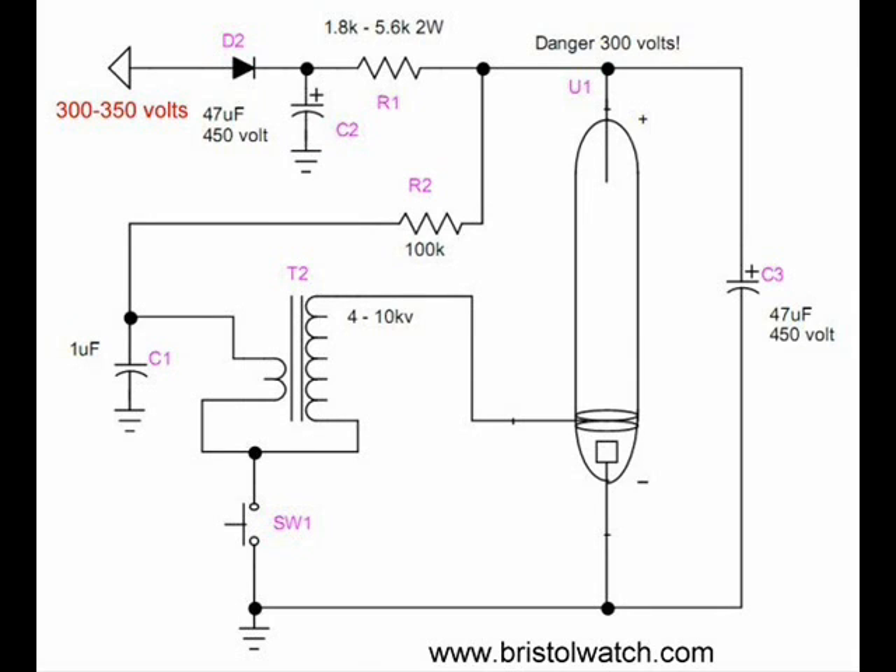In addition, we have a resistor R1. I call it a quenching resistor. What will happen without that resistor is when the tube is conducting, the capacitor will discharge but the tube won't turn off. Without that particular resistor, you can literally short the power line out through the flash tube and destroy the tube.